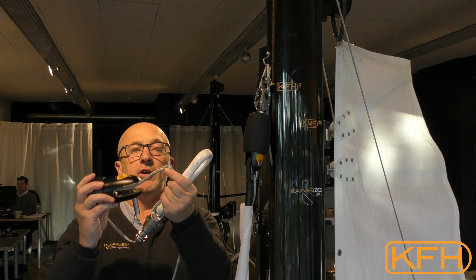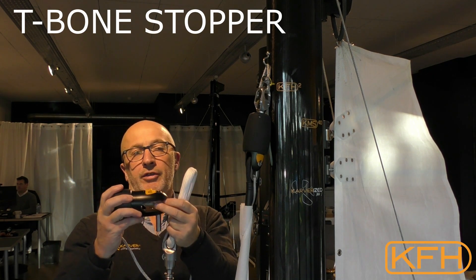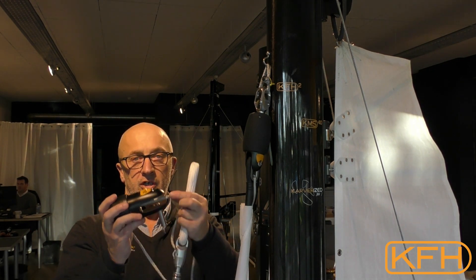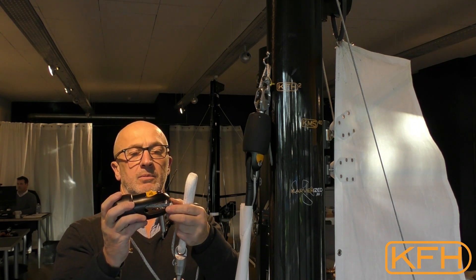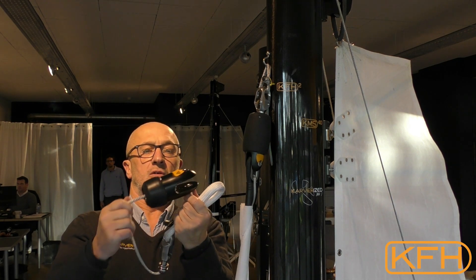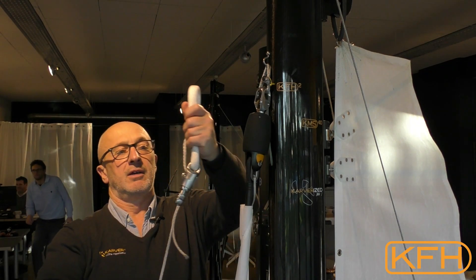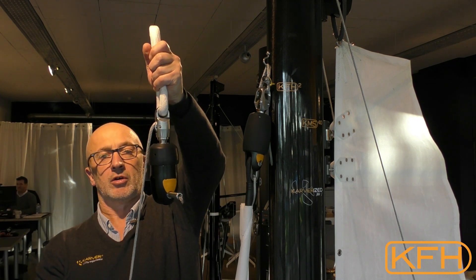At the end we will have a t-bone with a splice. The first size — the 1.5 — is with a knot, and all the other sizes above will have a t-bone like this. The t-bone will in fact slide and lock here when the halyard slides into the hook.